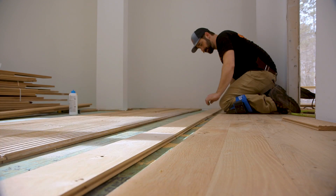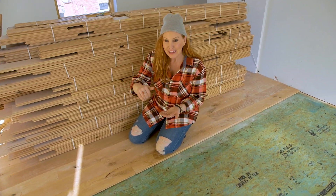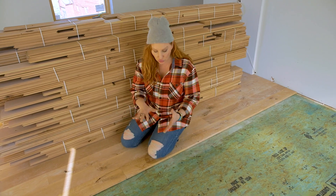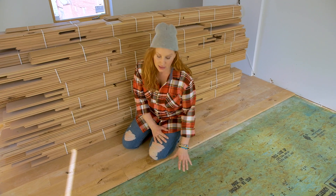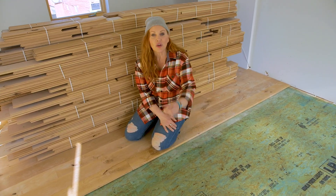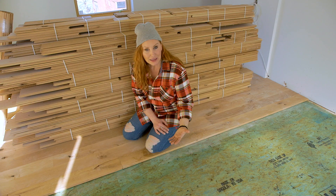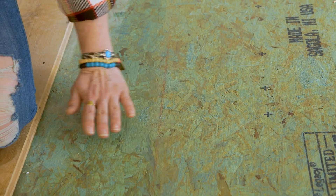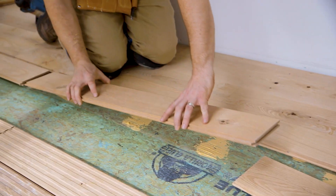The glue assist means that you can't just put regular tar paper or felt paper down and nail over that. You've got to actually glue onto the floor, which means the subfloor not only needs to be clean, but best practice is to put a vapor barrier down. So the floor was cleaned with a diamond blade rotary tool, then the vapor barrier was painted on and it dries in this lovely green color. And then on top of that, we do both the gluing and the nailing of the floor.